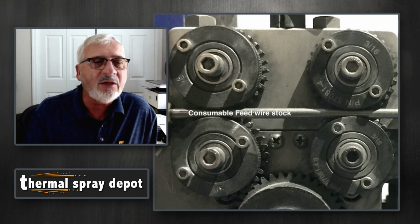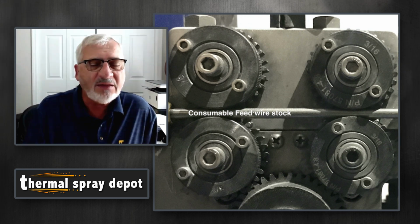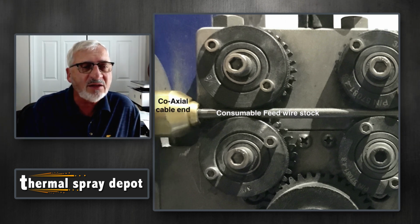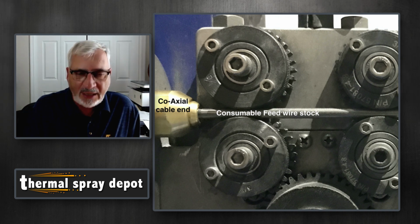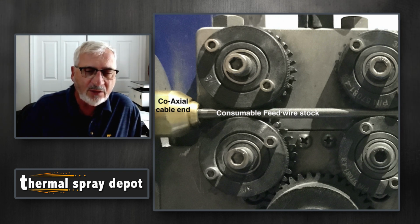So this is the actual wire drive rolls. And you'll see in the center there, it says the consumable feed wire stock. That's the actual wire we're going to melt. And that brass fitting on the left-hand side, that is the one end of the coaxial cable. And that is what connects the wire to that cable that takes it into the operator.